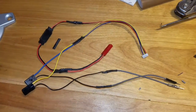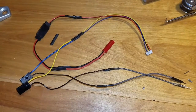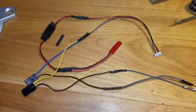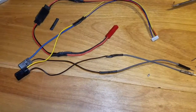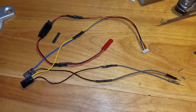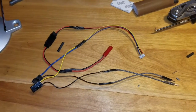There you have it, all wired up. The wiring harness: positive and negative are ready — red and black. Video out is the blue wire, video in is the yellow wire, and the blacks are the common ground running back to the battery.